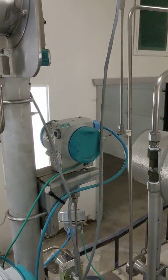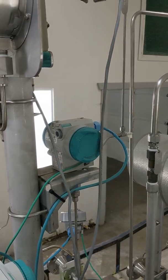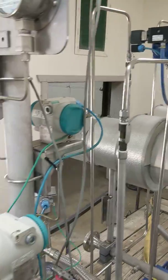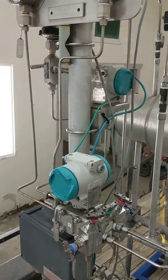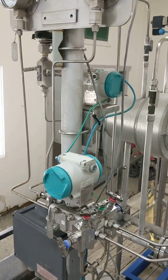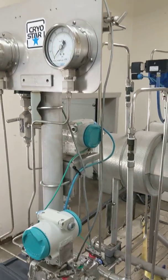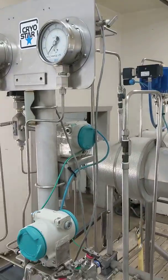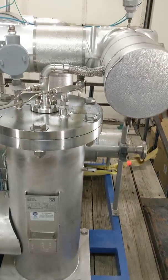Electrically, it's equipped with all these transmitters. They will read pressure differential, the flow rate, and even the temperature of the LNG. These will need to be programmed into the PLC, and they come with a 4 to 20 milliamp signal so you can read that signal remotely or through telemetry.